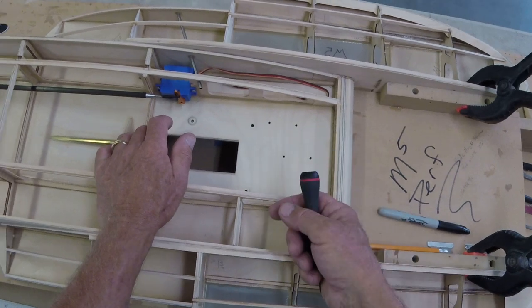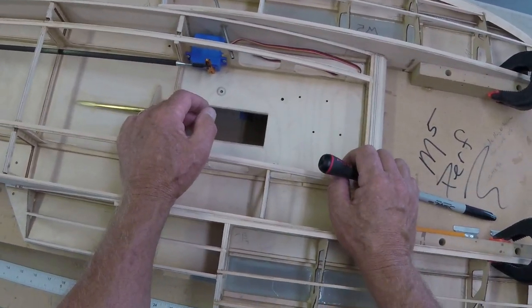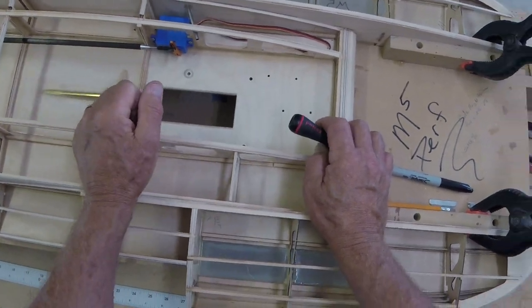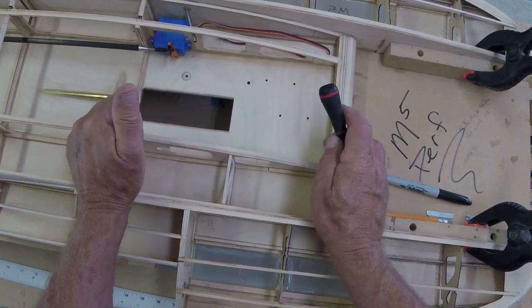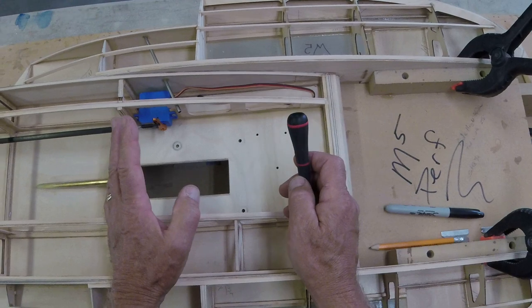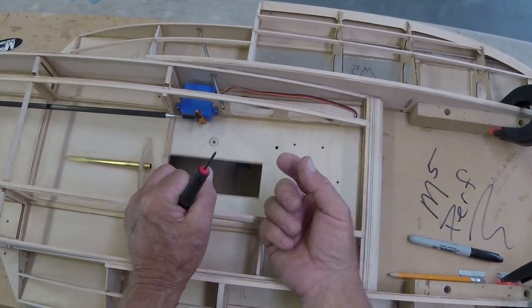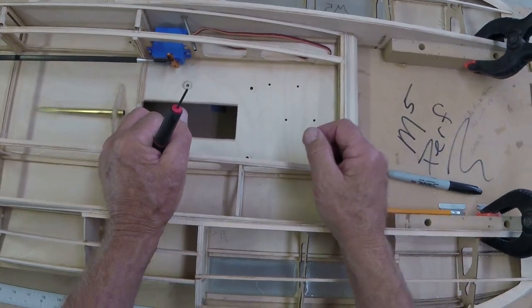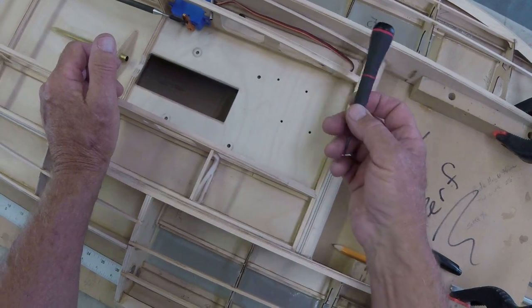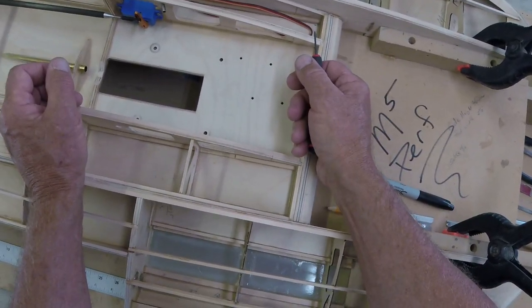I'm telling you, most of the time with my boats, I'm driving them between 1/2 and 3/4 throttle. And you almost can't notice any difference whatsoever when you pull the trigger further. It's a strange phenomenon, but there it is. When it's tuned right, it'll lean out just really pretty at that 3/4 to 1/2 throttle point and haul butt, and when you actually open it up, you're like, oh, I ain't got nothing. So anyway, that's just not a thing.